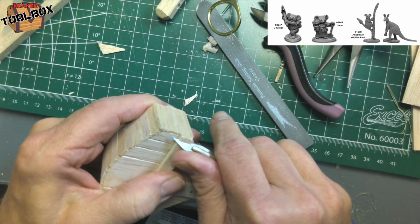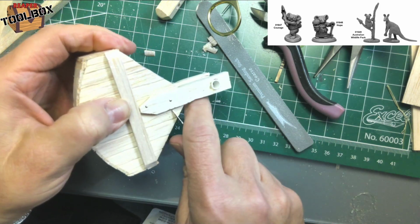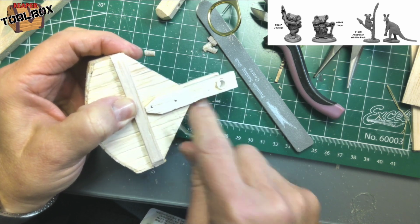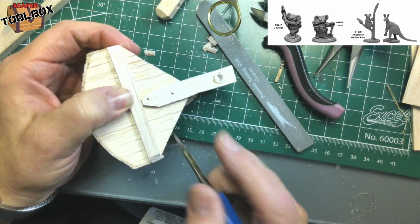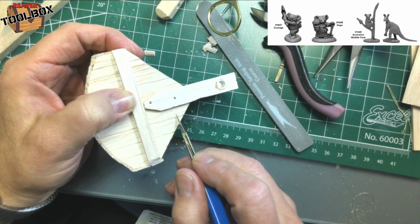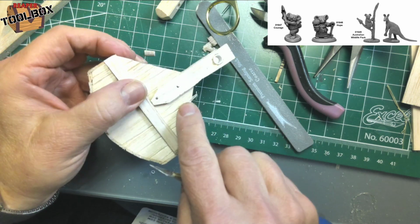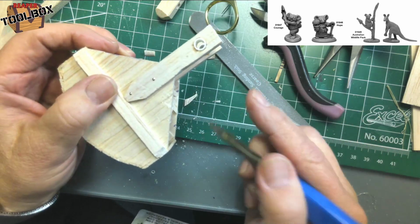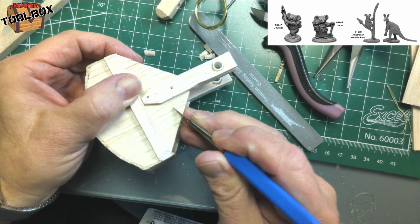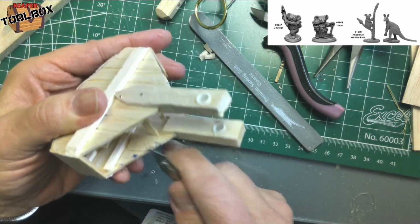Clean it up. Get it ready for the, because anywhere we have glue on the surface, which like I can already tell you is going to be here, it's just dried, I've got to get that glue off and take it back down to wood, because if I apply any paint or stain or whatever I'm doing, this obviously won't let it go through, so it'll just look like blotches. And you can see that's actually, well, in my monitor at least you can't even see it, but there's actually a layer right about that width there of some fingerprint of glue or something. Yeah. So we'll get stuff like that off, but we got a lot of cool stuff to do when we're doing it.